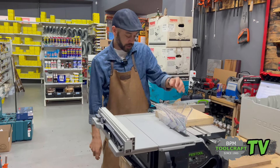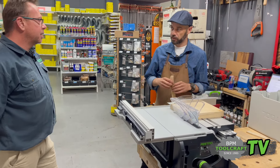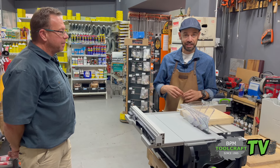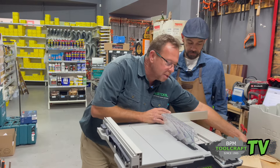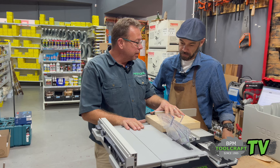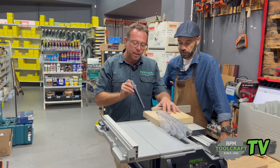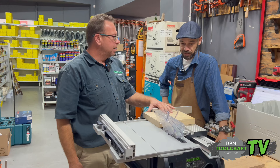Festool recommends nothing smaller than the 5.2 amp hour battery — so 5.2, 6, and the new 8 amp hour batteries. I haven't even tested the full runtime; I haven't finished two batteries in one day. Another brilliant feature I love about this machine: whenever you start cutting and you realize you need your push stick, it's always faffing around the table. Festool made it very easily accessible from the top — there's your push stick, and you can safely do your cuts. When you're done, simply put it back — always handy, always close by for safe cuts.